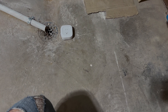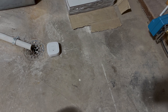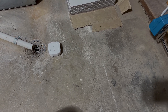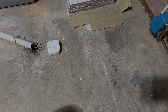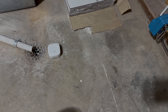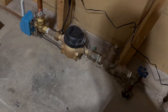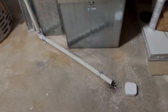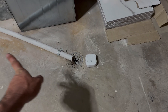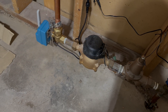The kit also came with three leak sensors, and I also purchased three new ones. The ones that come in the kit don't have a speaker built in — they're the leak sensor version one. You can get the version four in a three-pack online; those have an alarm built in. I think they last three to five years off a battery. They're wireless and very easy to add in the app — you can name the room you put them in. In the maintenance room here I've got my hot water heater, and everything slopes down to the drain, so I'm going to put it right above the drain at the low point.